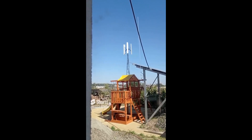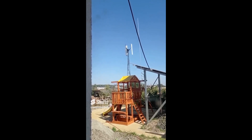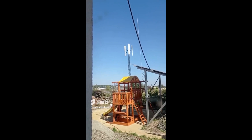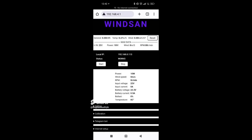The main thing is we're here to test it. The wind is five to 5.5 meters per second right now and it rotates quite nicely — you can see how the cable from the solar panel is moving and how the leaves are moving. Let's see the wattage output. The max I was able to record: 10 watts at 23 volts. That's it — the absolute maximum.